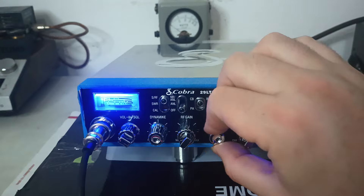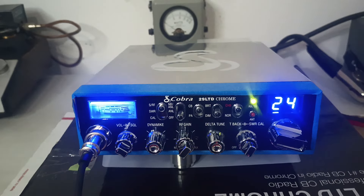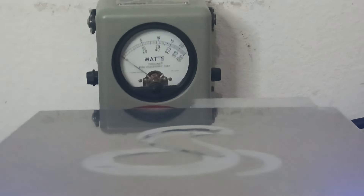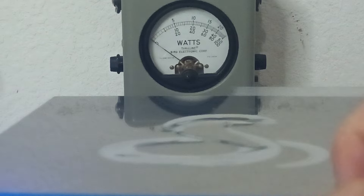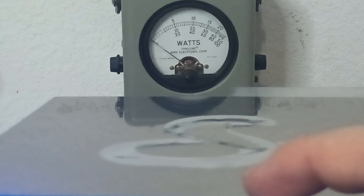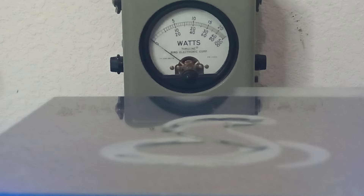Your variable power or dead key is going to be right here on the Delta tune, and we'll get into the performance of the radio. We're testing at 14.6 volts right now — so just for reference, 14.6. We've got a 250 slug in there right now. We're going to be looking at the top scale of this thing. Just the way the RFX is, it takes a little bit of dead key to get it to start responding.